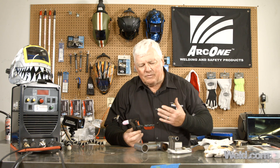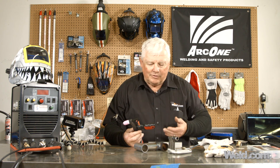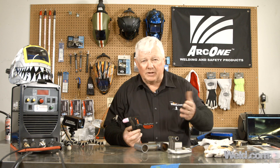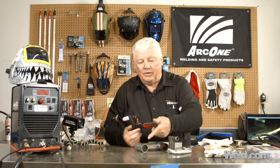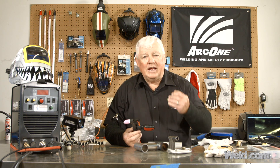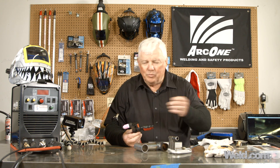The breaker trips because most of the time you're just plugging into a 15-amp service, and that's all I've got in the field. So what I want to show you is if you're trying to weld or repair a frame, or even build a frame for your NHRA top fuelers — they're using bottom rails of about 0.093 wall thickness, plus or minus — this will do the job. I'm actually going to do a weld here on 4130 chrome moly. At the high end, it'll do an eighth of an inch, and that's what I'm rating this machine at.